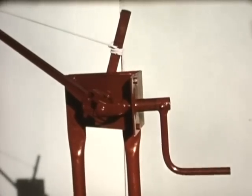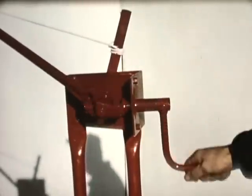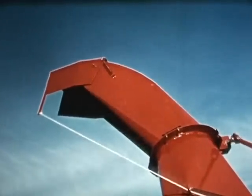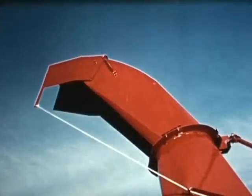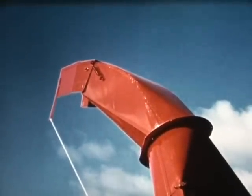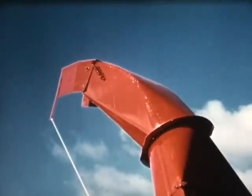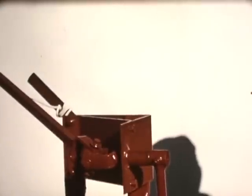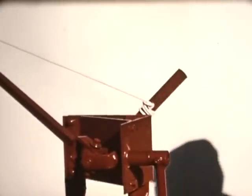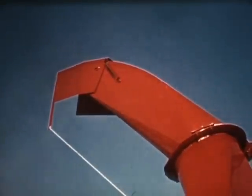The rotating deflector attachment is controlled by a crank which can be reached from the tractor seat. It gives you directional controlled loading with no crop loss when making corners and easy truck loading. This stationary rear loading deflector is convertible to a rotating deflector and comes in two optional lengths. The deflector cap lever is spring-loaded for positive delivery, guaranteeing full loading from rear to front.